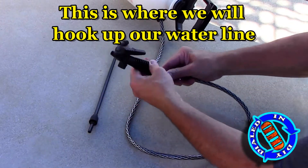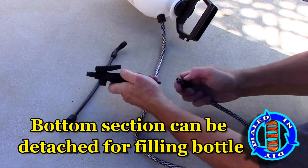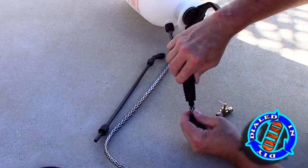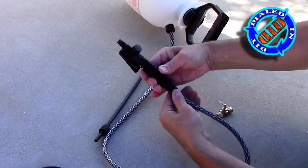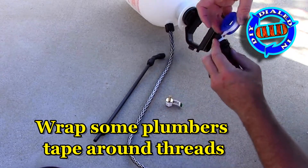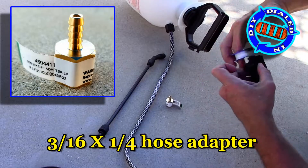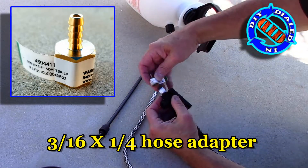When you pick up a sprayer for this purpose, I suggest taking the handle apart and seeing the different places it can be separated. This will give you an idea of what your options are for fittings so that you can connect it to your nozzle line. The other benefit will be if you can keep the handle intact and just take the end of the sprayer off — you still have an on-off switch that you can easily use, and you'll still be able to detach the hose below the handle to separate the tank and go fill it up.